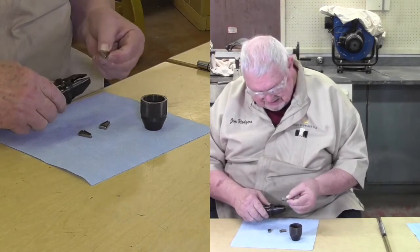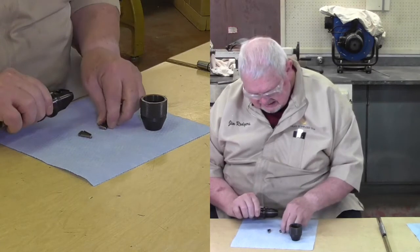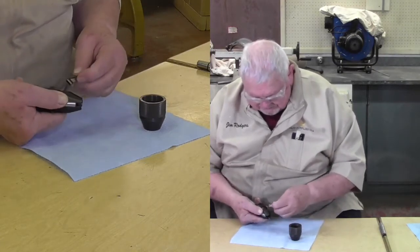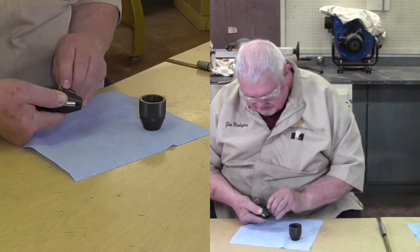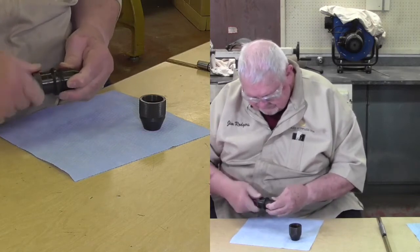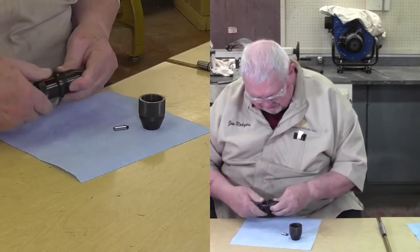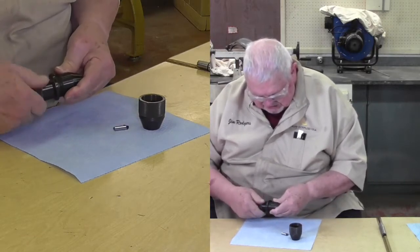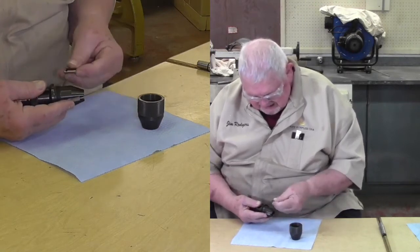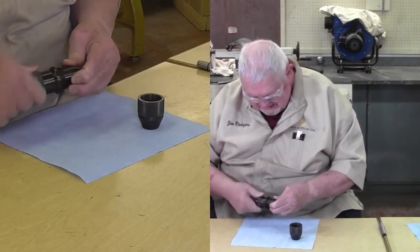The jaw with the V shape drops down into the slot. Down into the slot. Third one. Down into the slot. And I'm going to advance the chuck a little bit. This locks them into these slots almost. I forgot that one didn't lock in. So I'm going to come back down, holding these two jaws. Put this one back in place again. Hold all three. Advance it.